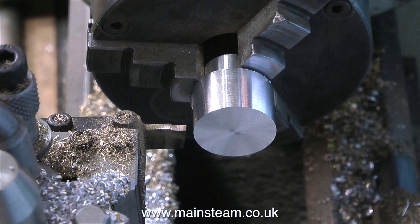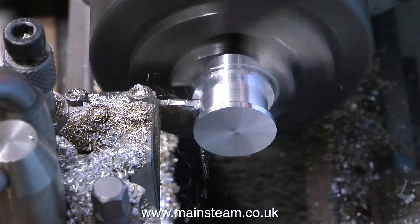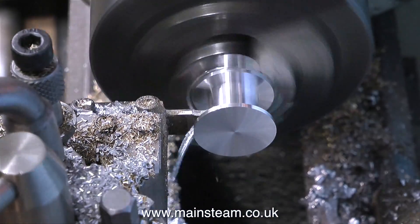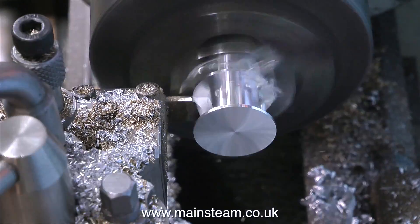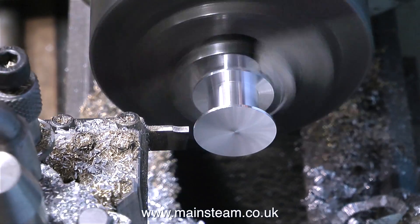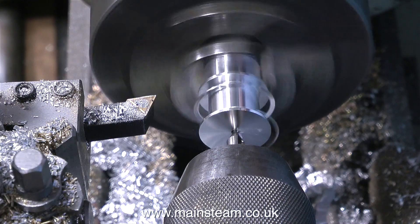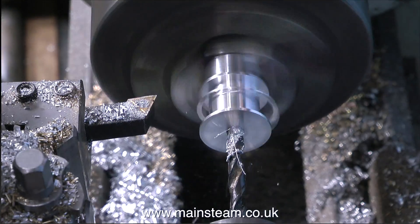Now it's time to fit a parting tool to cut the pulley to its final size. This part of the sequence is speeded up. I'm machining the inside of the pulley down to three-quarters of an inch — that's why you keep seeing the micrometer coming in and out of shot. I'm also using the drive belt to gauge the width of the pulley, and eventually I get it to the right size. Then I reduce the outer diameter of the flanges before making a hole down the middle of the pulley.